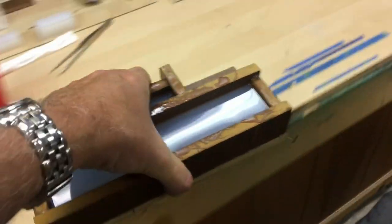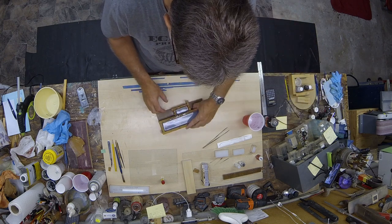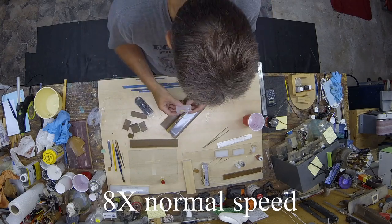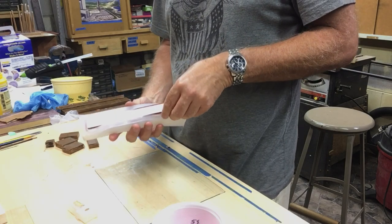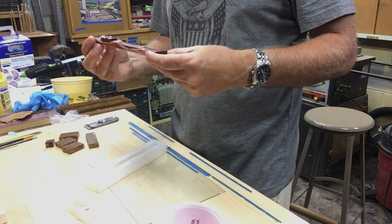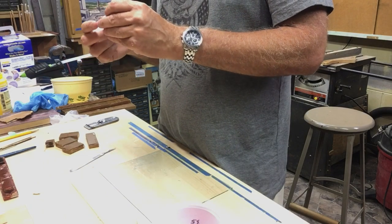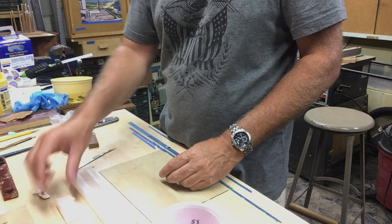And we can pull away the mold box sides and remove the masters from the mold. The masters were sprayed with a silicone release agent prior to pouring the rubber on them, so it pulls out fairly easily. We take a look at the master, make sure that it's in good shape, that nothing was left in the mold, and we put it away for the next time we need to make another mold, because unfortunately the molds don't last forever, they wear out. So we keep the masters so we can always have another copy ready to go.